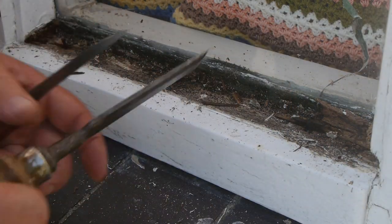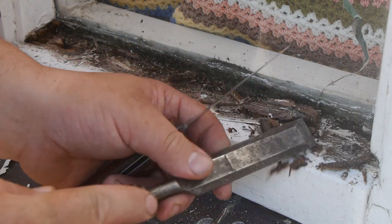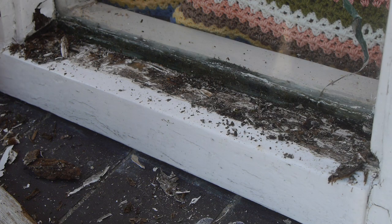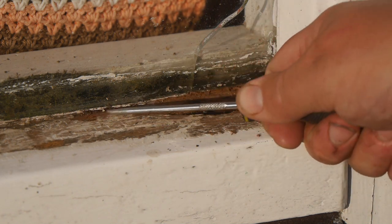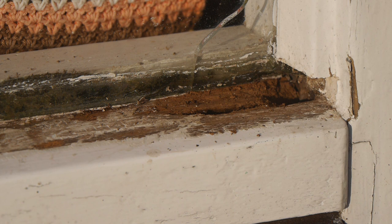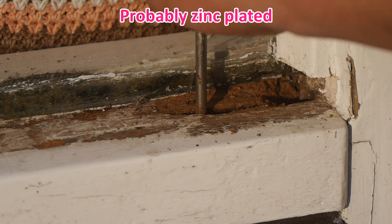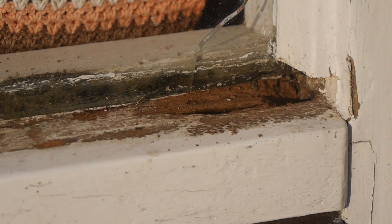It's pretty loose - got it. The nail stayed in the corner and there's also a bit of rot. The other nail also stayed in the window frame. The wood on this side of the house has a rather hard life - there's more rot than I expected. This here is a broken-off rusty nail. Back in the 90s when this frame was rebuilt or modified they used nickel-plated nails. I try to use stainless steel when I can.